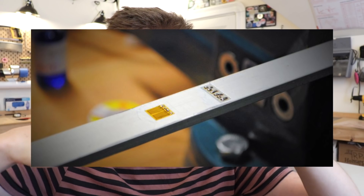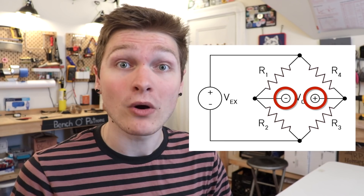The sensor itself is kind of dumb though — it doesn't spit out a number of kilopascals. It is effectively a Wheatstone bridge, which is an array of resistors where a few can change their resistance when deformed. A lot of people put Wheatstone bridges on beams — when the beam bends it stretches those resistors and changes their resistance, and when those resistors change resistance the voltage at certain points changes too, which lets you measure deformation. This little component is essentially a Wheatstone bridge on a little flexure disc that changes with pressure. It's pretty freaking awesome.